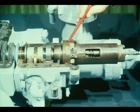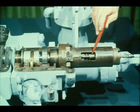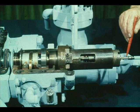With the governor hood taken off, you can see the governor case, which encloses the parts of the constant speed governor. This case is heated and shrunk onto the end of the shaft. Therefore, for all practical purposes, the governor case and its contents are an integral part of the rotating assembly. This is necessary for the governor to function properly. The workman is pointing out one of the three weights on this mechanical shaft governor. The position of these weights is the prime factor in control of steam flow into the turbine.